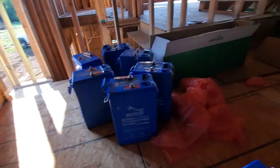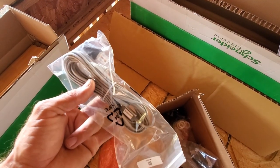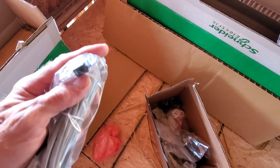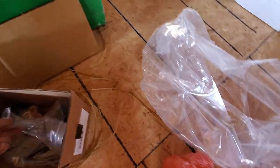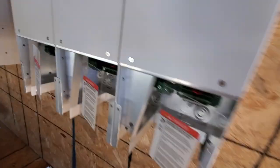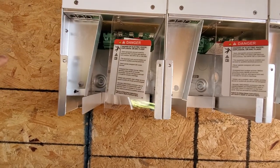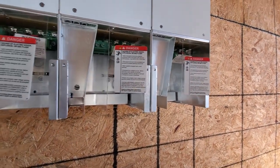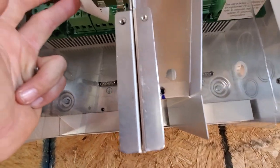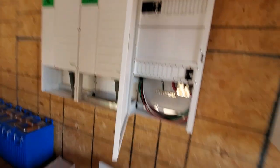So each of them comes with a fuse. This is the bag it comes in. This long cable here is the battery temperature sensor. There's your fuse. That is your network terminator — so if you're only using one of those ports, this would go in the other one. All these things talk to each other. I'm still waiting for my wiring schematic to show up from the company. This one will go over to the other system, this one will go to that one, that one will go to that one, and this one will get a terminator — that's what I'm assuming, but we'll see. Down in the bottom of this is where your solar panel wires hook in. They have three ports there but we're only going to use two on each side. I don't quite know why they have three when they say you can only use two.